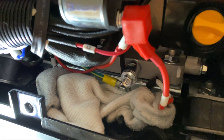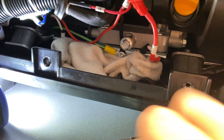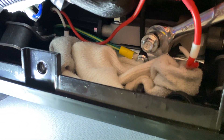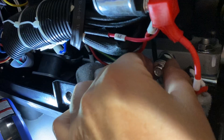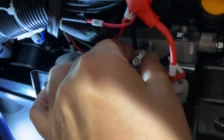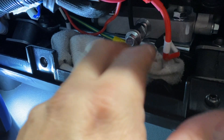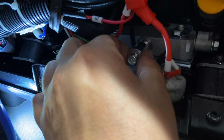With the side cover loosened, we're at the drain plug. Take your 13mm wrench — you don't want to place it on the drain screw itself. Place it on the back on the main piece of the drain and break it loose, then unscrew the whole thing. It's a good idea to check the oil first and make sure there's not still a bunch left. They leave some in after break-in but drain it all out, so you'll still have some residual — otherwise you'll have a nasty surprise when you pull it out. Put some rags under here to catch that residual drip.